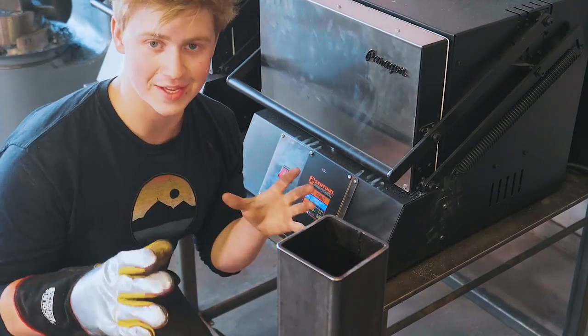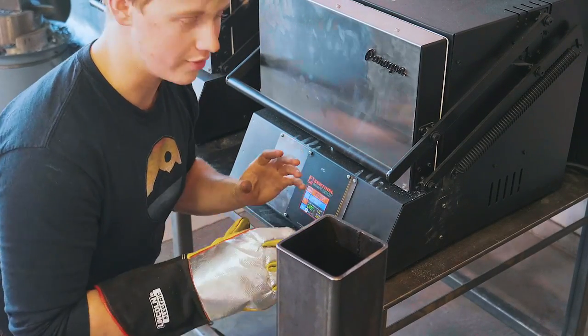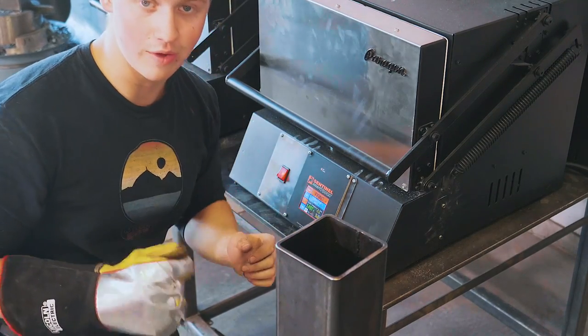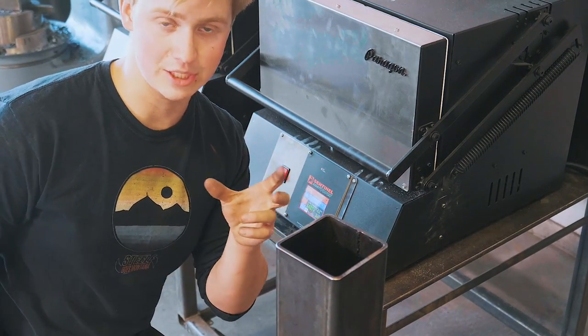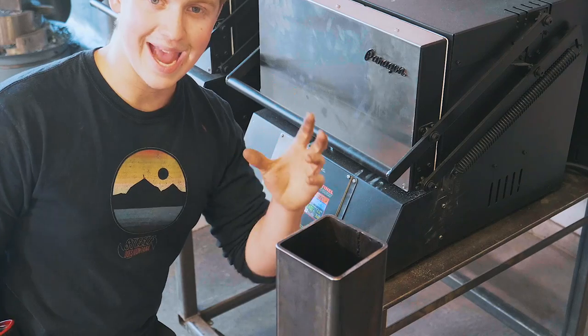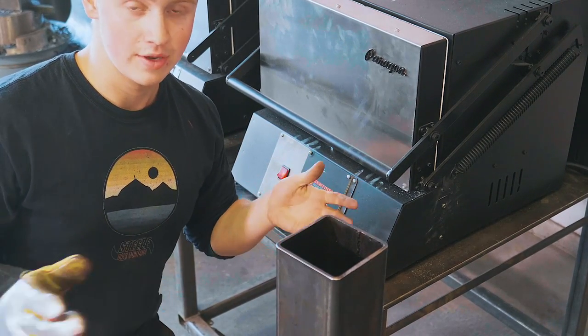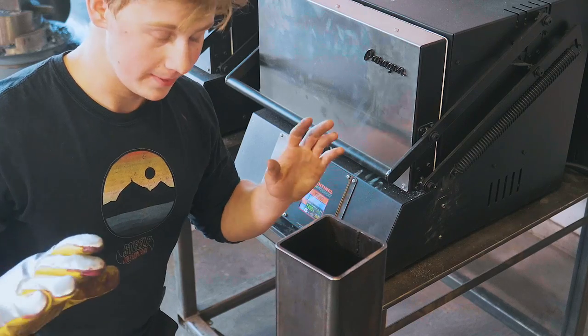Okay, I've got the Damascus handle pieces in the knife heat treat oven right now. I'm about to take them out. They've got some wire around them, and I'm gonna quench them in the oil. The reason that we harden these Damascus pieces that aren't on the blade is because they etch a lot better when they've been hardened. I don't know why. Nobody actually knows. We think it's magic.